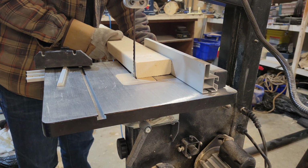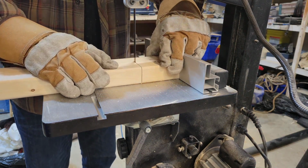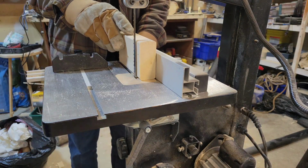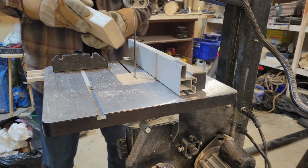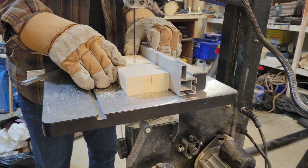Today I'm making a lidded bowl and scoop for sugar. To start out, I cut 2 squares of 2x4 and a longer piece as well. And that longer piece is going to be for the scoop, but I have to make that piece a square also. That way it fits on the lathe a little better.